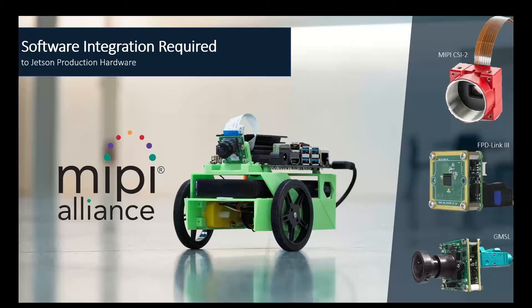Next, we're going to talk about the other vision interface options: MIPI, GMSL, and FPD-Link. Outside of USB and Gigabit Ethernet, these are the other main video ingests that Jetson accepts, but it's also where integration work is required. Advantages of MIPI include high-speed real-time processing of raw image data, ISP processing capability, high-resolution and frame rate flexibility, and low latency. As it avoids the additional processing complexity of USB and GigE Vision, there are cost savings with MIPI sensors as well.